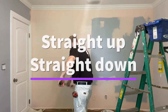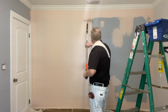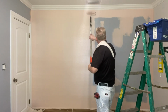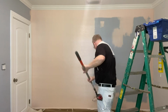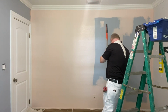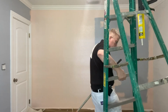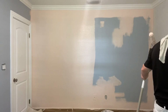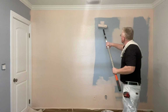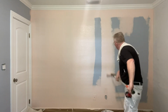Do you think it would be proportionately equal in terms of thickness, or what we call millage of the paint? It wouldn't. If you took a loaded roller, like I'm doing right here, and you brought it right up against the pink, guess what? You would have a disproportionate amount of paint applied near where you left off.